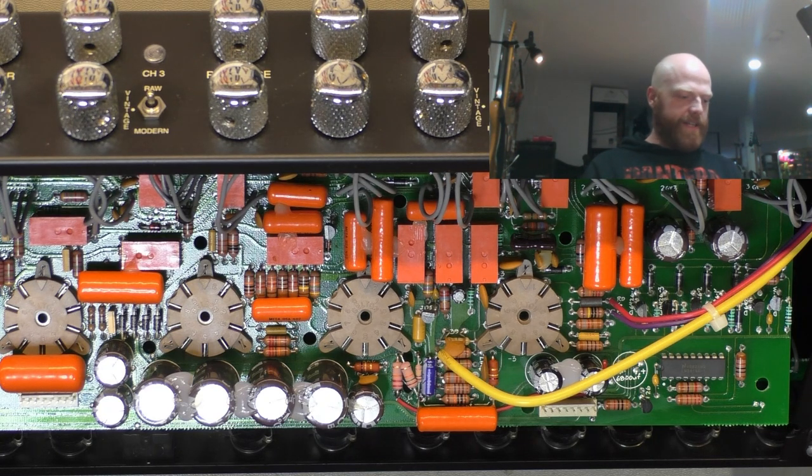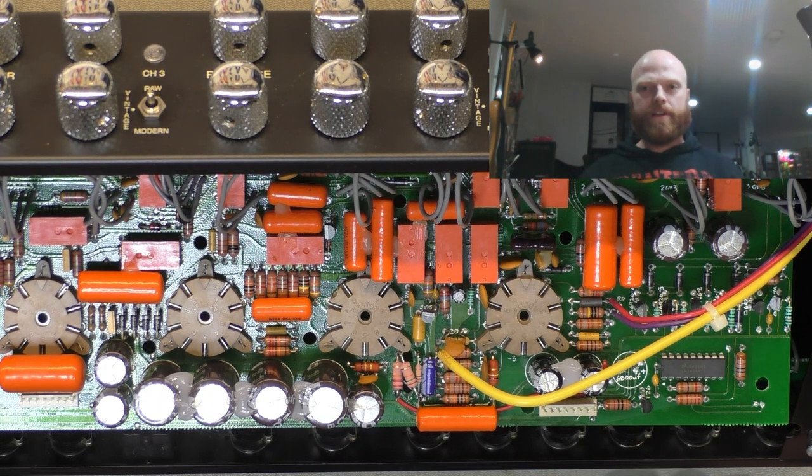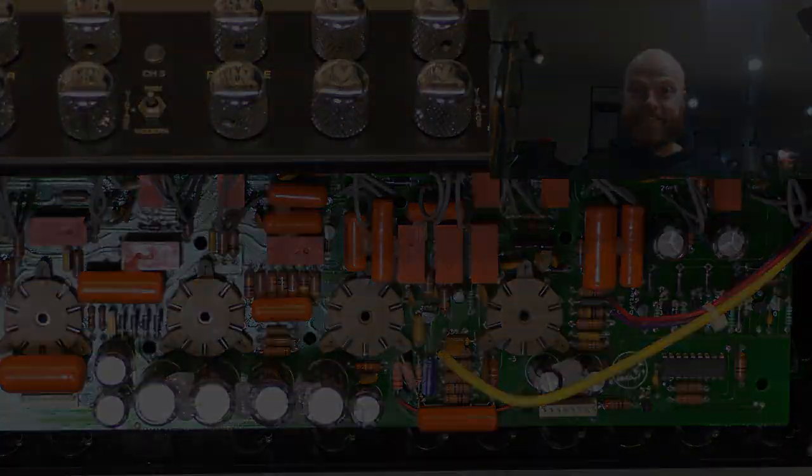And Mesa don't make that easy with their no component designators on the board. It doesn't say, you know, R24, it just has a value under the resistor, and it doesn't correspond to anything on the schematic. Schematics are often inaccurate and completely wrong. They make field revisions on the fly and don't document them. So yeah, they're fun, but hey, someone's got to do it, eh?